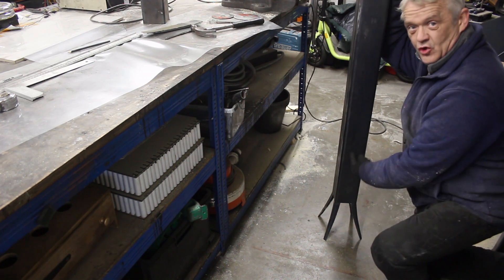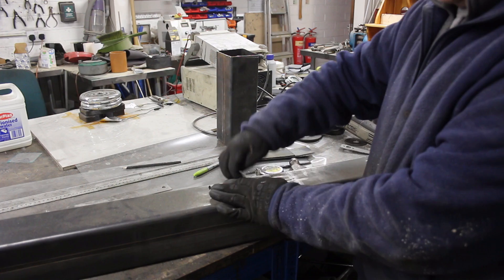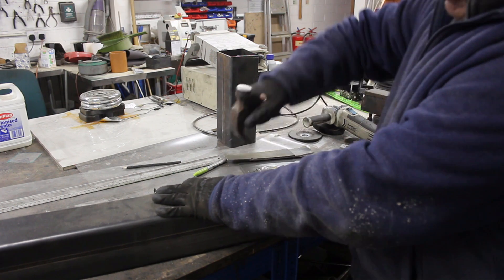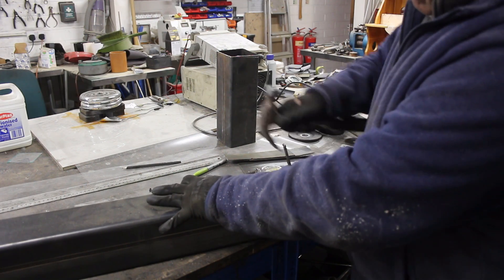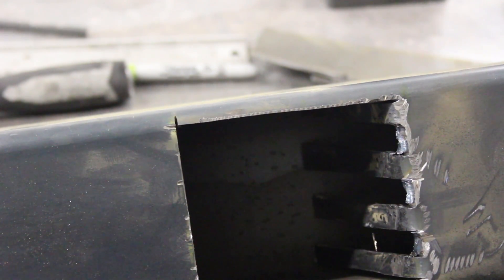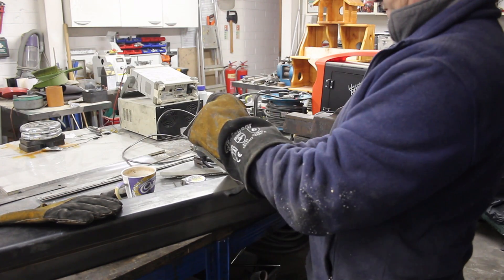About a quarter of a meter up, I'm going to cut a 4x4 door in it. Notice I've cut around here but not across there — I've cut these in tongues, because every second one gets bent out and the other one gets bent in, so they make their own grate. Two little bits of welding: we weld the grate down, and then I've cut a 45-degree angle and we can weld the 45-degree feeder on like that.